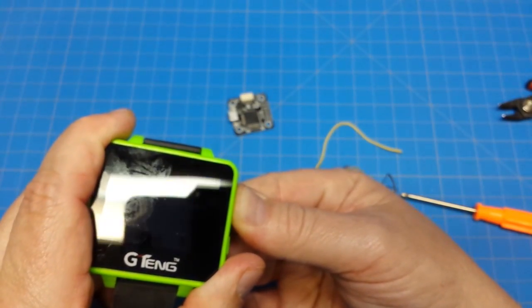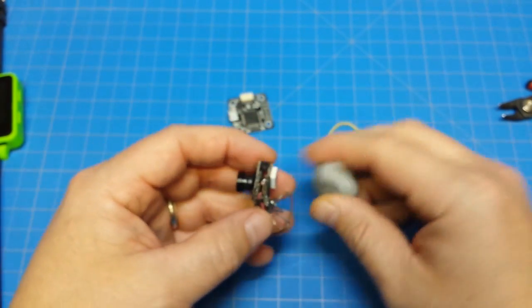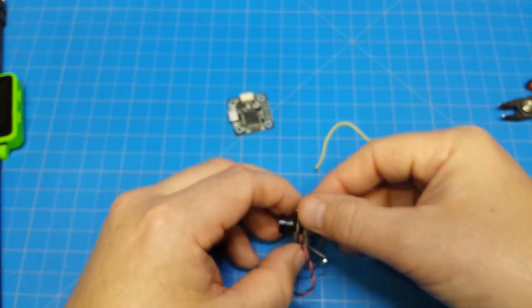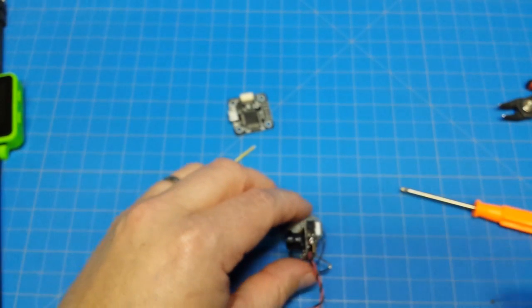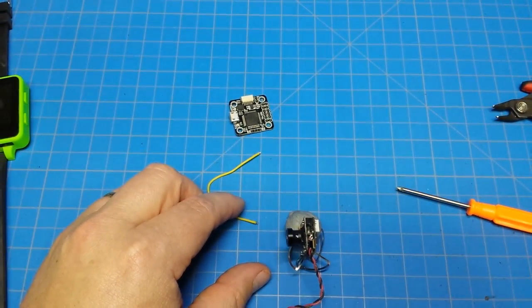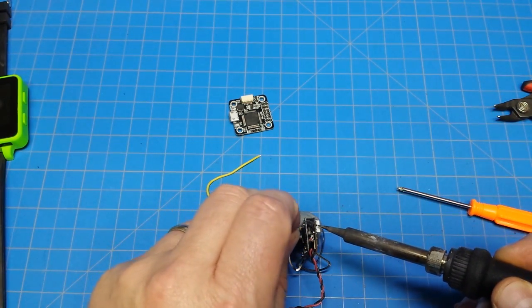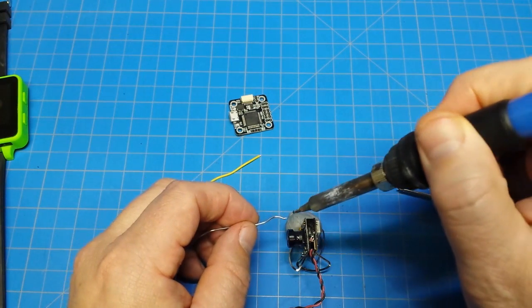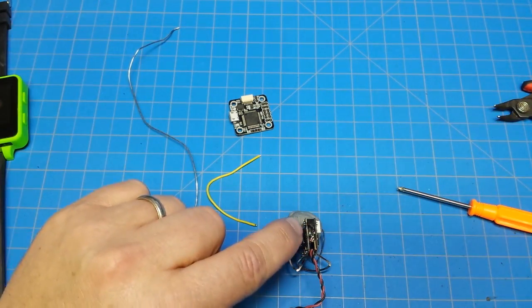The next portion — I'm going step by step because we want to be safe and not wreck our equipment, and then have to wait three weeks for another order and be another twenty-some dollars down. I've already added a bit of solder to these, and I'm going to do the same to these pins. All we're going to try to do is just tin up this outside portion — just get in and get out real quick. Try not to touch the PCB.